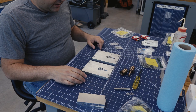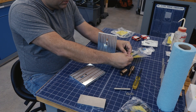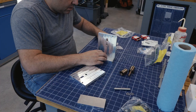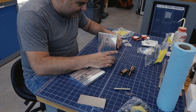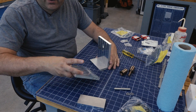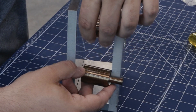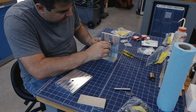This material is supposed to slightly shrink during heat treat. These bearings should go into these machine grooves right here. Now the way this is going to work: we've got these screws which will hold, and we're going to form a little rectangle with these pieces of aluminum — it's just half-inch aluminum stock with some holes machined into it. I did machine these myself, so we'll see how the tolerances are. The lower roller goes on the bottom, and the upper roller goes on top on a shaft that moves up and down so we can set it for different thickness materials.